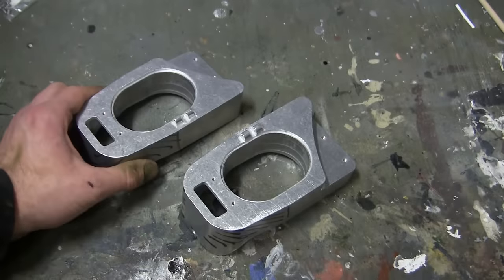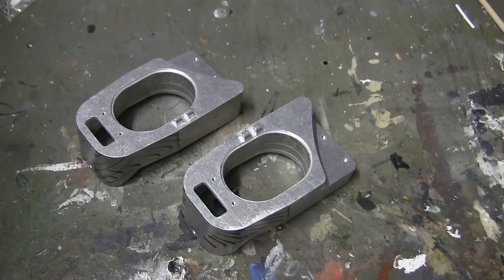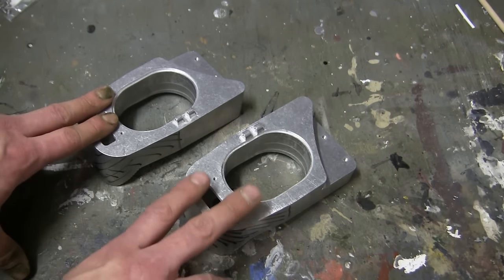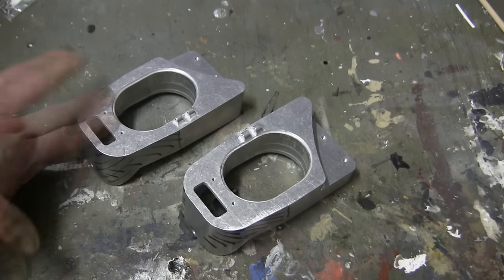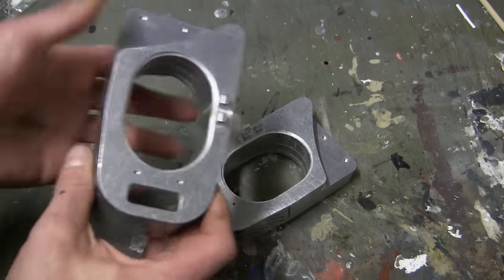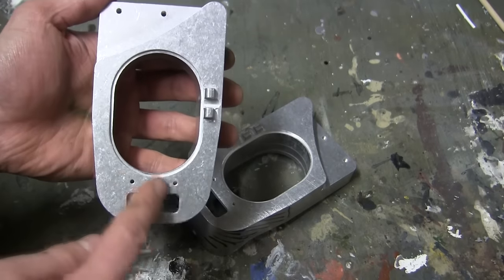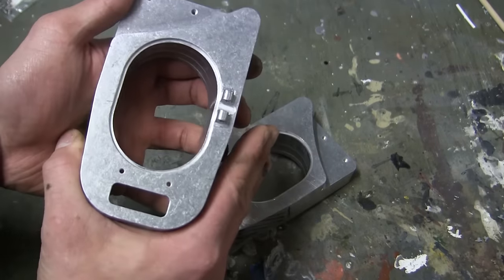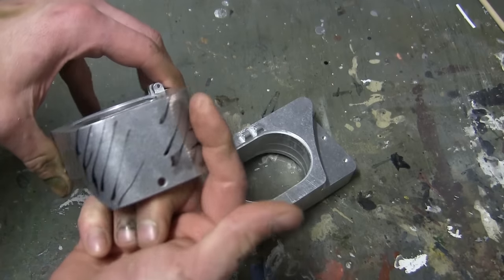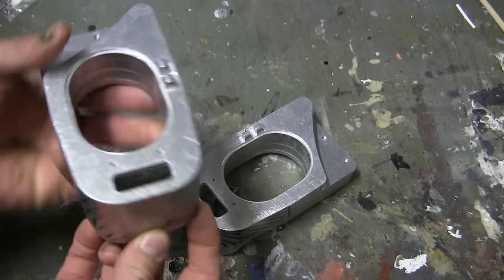The kit does supply you with two CNC basic hatches. However, for this model, just like with my A4, the kit hatches are not going to be utilized. Resin hatches will be put in their place. In addition to removing the kit hatches, some hand fitting is required in order to get the hatch wells to fit properly on the front glacis plate of the kit. Material will be sanded away on the belt sander in this location until the pieces finally lock on.